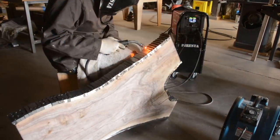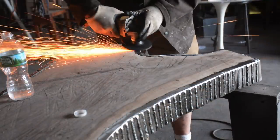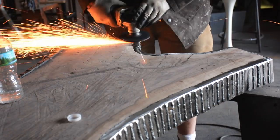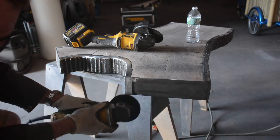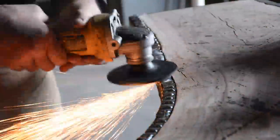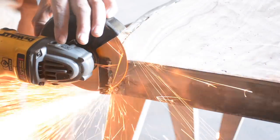This is a perfect example of going with your gut and seeing where it goes. I'm doing the other side now - there were ultimately 130 pieces, so do the math on how many welds that would be. By the end I got really good at throwing down a bead. I was able to fill in all the spots where the screws were, so the whole belt of steel around the outside edge becomes one full piece embedded into the slab. I threw a bead on top between every segment, grinded it down, then went back in with one long bead right at the edge to fill in all the square shapes.